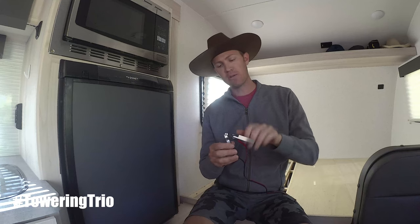That's how I determined it was the sail switch — I confidently confirmed I had an issue because it was not closing. I couldn't put all this together inside with the furnace in, so that's why I came up with these jumper cables. Then the sail switch stopped working entirely. So I thought: it's just the switch — all I have to do is connect the circuit. Connecting the circuit is the exact same thing as closing this switch, or the fan motor blowing air against the sail — hence a sail switch — and closing the switch, completing the circuit.